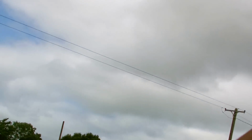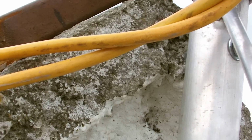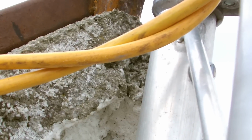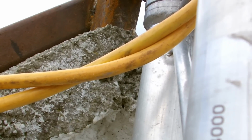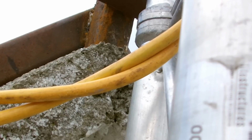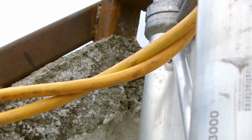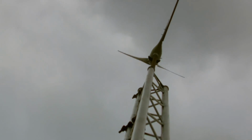Right, turn that off, go back down the ladder and I'll have a look at what it's saying on the watt meter. Those are the cables. I upped the cable size. I had to run two up. Now that might be an issue. So it's 3-core cable, and it's about 3 mil as a wire. So I thought if I doubled it up and fastened them both together, each end obviously, you end up with 6 mil cable. But anyway, you might have an issue and a comment on that. Let's see what you think. Go back down the ladder.